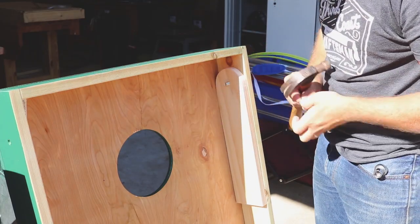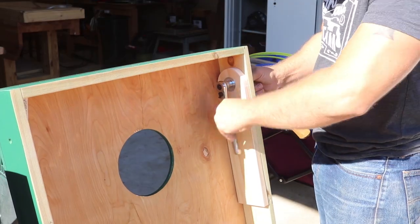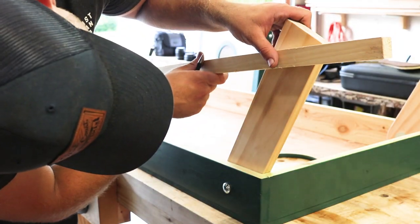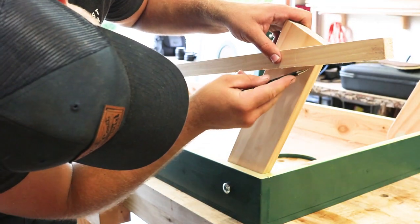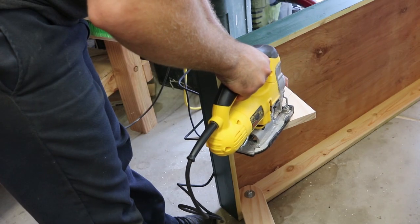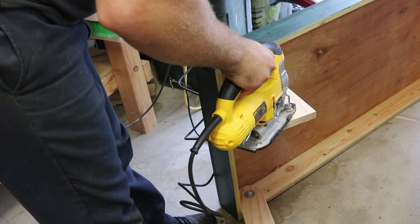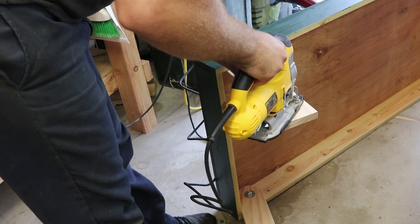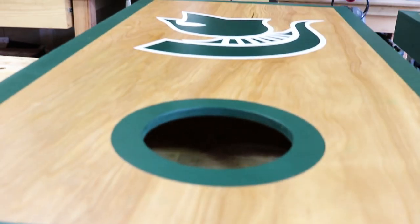I install the legs and cut them to the right height of 12 inches. The easiest way to do this is to flip the board over, make a small mark at 12 inches up from whatever surface you flipped it onto, then take a long scrap piece and rest it on the other end of the board, line it up with your 12-inch mark, strike a line, and cut it at that length. The feet will then have the proper angle and sit at 12 inches off the ground.